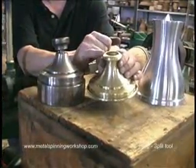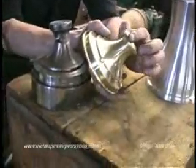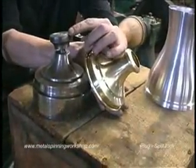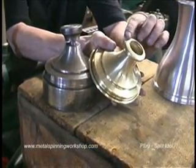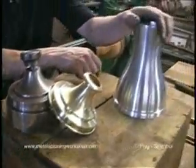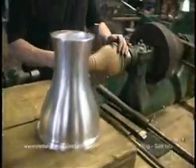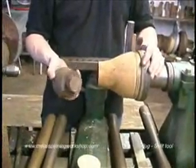Now, this also on the end here, if you can see, has a rounded edge. What's happened is it's been trimmed on the nose here, then it's been put back onto the mandrel, and this has been spun over with air spinning or spinning on air. But for the demonstration, let's concentrate on this lamp base, because the lamp base, if we look at the tooling, it's a much larger size and it's much easier to understand.